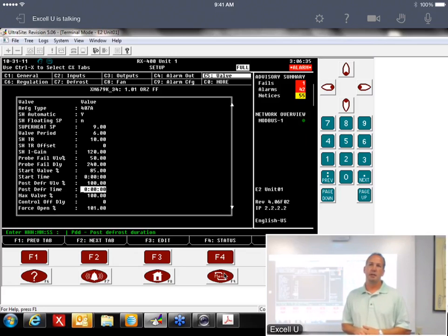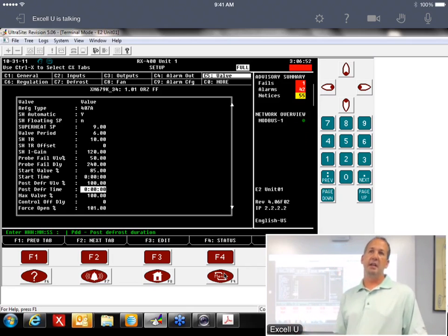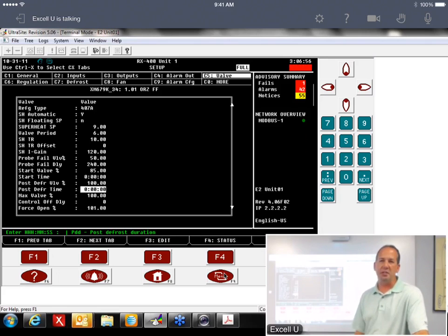So we won't even look at superheat for that time period? No, because it's in override. Ouch. It's in override. Even in recovery with a CCB, it still modulates. Right. Well, that's why I suggest I wouldn't even mess with it. It's there if you need it, but it defaults to not active, and like I said, it really shouldn't need it, but it is there.